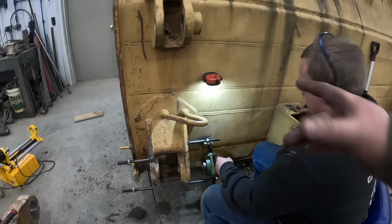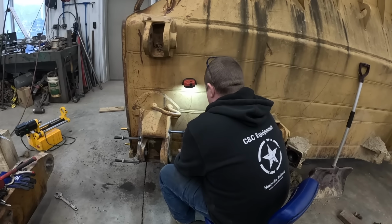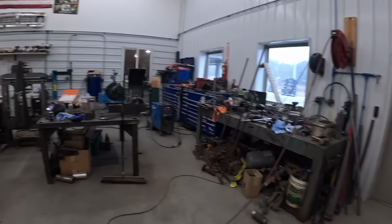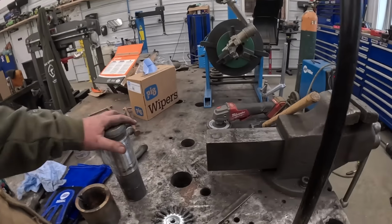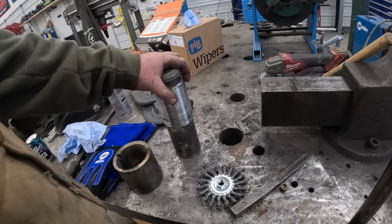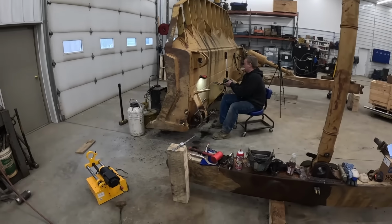That's right. All right, he's gonna get all tore down, ground up, ground off, and so that pin there, we're gonna use the original pin. We're actually gonna weld it up. We could make a new one, but the weld is pretty tough stuff, so we already got this side done. We'll have to weld this side up and turn it down. This is the one we're gonna put that step in because he's got that one side bored out bigger.